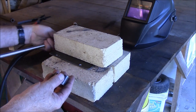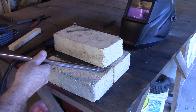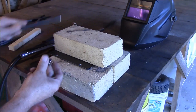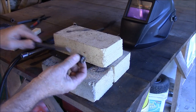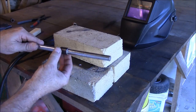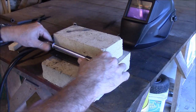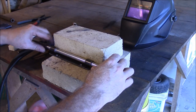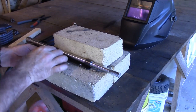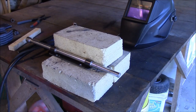Here are a couple of pieces of pipe, and this is actually a rod that's bigger than the bolt that's gonna slide through there. If I use the bolt itself it's not a tight fit and they could get out of alignment, so I'm using this larger rod because they can't get much out of alignment with that. I slide it up on there, let it lay against that back plate, line it up on both ends, and then give it a little spot weld to hold it.